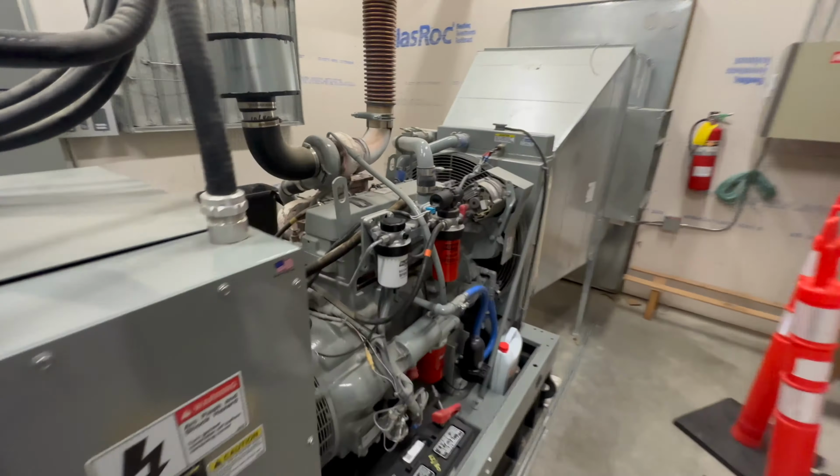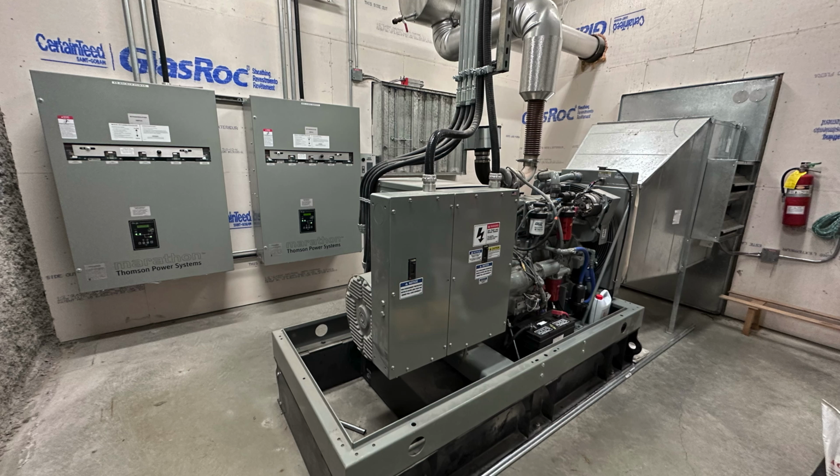I know I didn't film the whole process. I didn't want to be bugging the guy too much because I wasn't sure if he wanted to be in the video necessarily, and I didn't want to be too annoying. So like I said, we have to go around the school district and test all of the generators for 2 hours at their rated load, or at least as close as we can get to it, because this one was a lucky one that you could get the settings on the load bank right to 60 kW, and it's a 60 kW generator. But some of the generators you don't get that lucky, and you'll be under it on one setting and then the next setting goes over, so you have to go with the under.